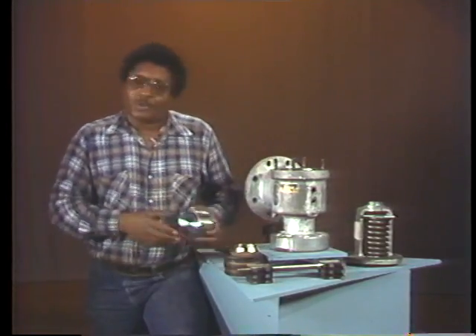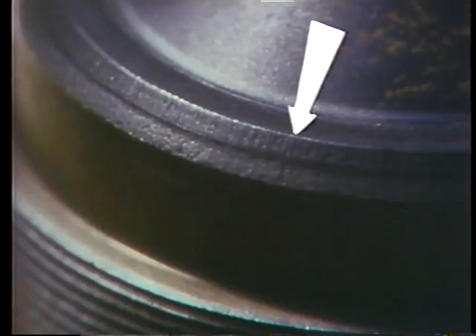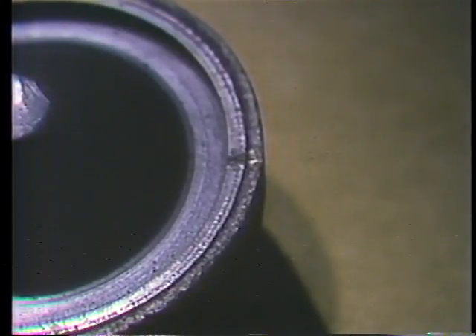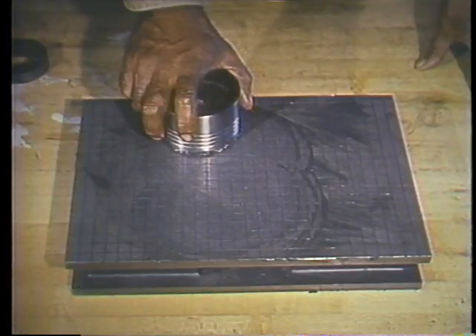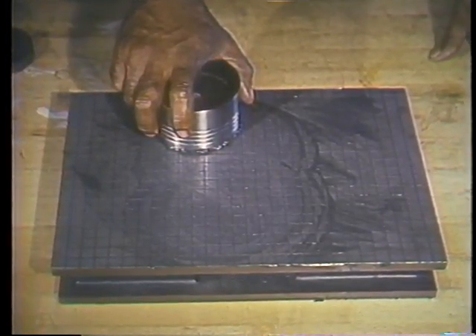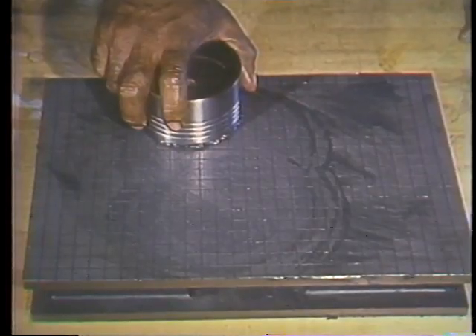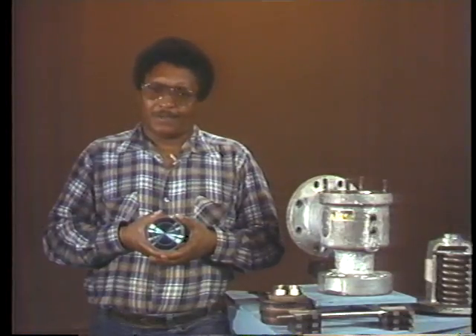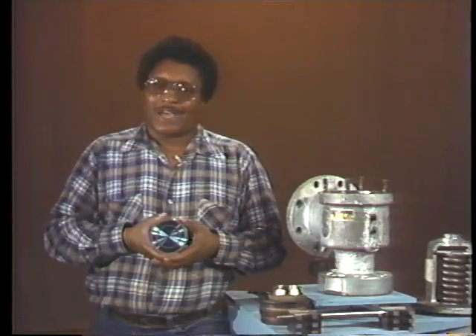We'll start with the feather. When inspecting the feather, the first thing to look for is cracking — even the smallest cracks are serious and a cracked feather must be replaced with a new one. Steam cutting is another common problem with feathers. If the damage is severe, your supervisor will probably recommend replacing the part. If the steam cutting is relatively minor, you can usually restore the damaged surfaces by lapping them. Because this feather is flat, it can be lapped on a lapping plate using lapping compound as the abrasive. If the damaged feather is round or cone-shaped, it cannot be lapped the same way — your text gives information on how to repair feathers of various shapes.